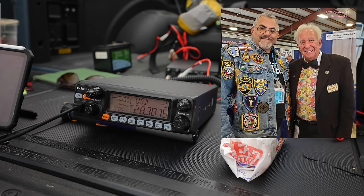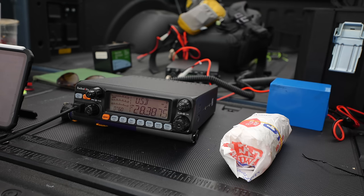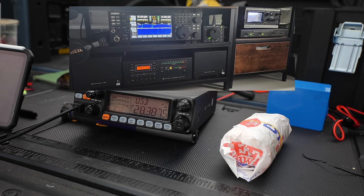Oh, that's fantastic there. Well, it's doing a good job. We're looking for good propagation. We don't need it, we just need decent propagation, but your setup is doing really good there. Not a problem. I'm on an Elecraft radio, K4D, Elecraft amp, KPA500, probably pushing over 400 watts. The mic is a Heil ProSet 40, and up about 45 feet on the towers, an 8-element Force 12 Yagi.